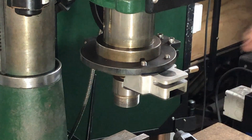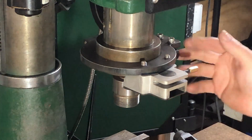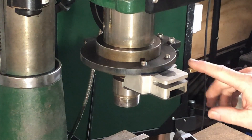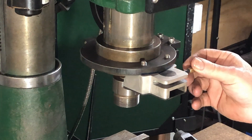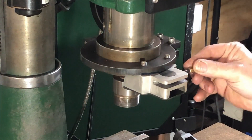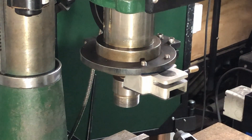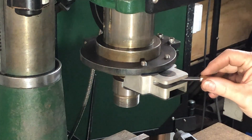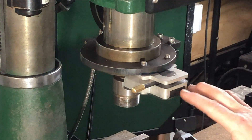It goes all the way in on the other side, so that's all locked up and I'm able to tighten and loosen the collet nut with my other hand free to hold the tool. A couple of comments on the video asked about putting an interlock in case you start it up while locked. I didn't plan to do that, but I have started it up when locked - the pulley slips on the belt and I can quickly turn it off without causing damage. It's spring-loaded as well so it flips back into the unlocked position, which stops it from vibrating in the lock position.